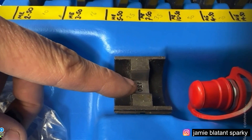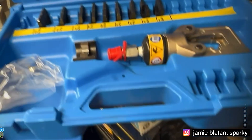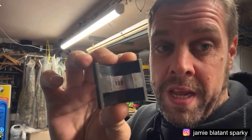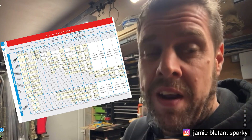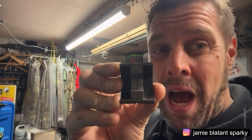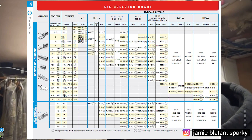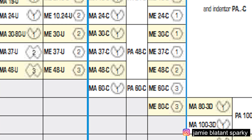What'll happen is - I think with a 120 - if you look in the back of the Cembre book there's a guide. I'd buy my lugs off Cembre, my dies off Cembre, my crimps off Cembre, because it's a package system. For the G head, I think a 120 you crimp it once. You don't crimp a lug down with as many crimps as you can get on - you crimp it according to the crimping chart. With the thin head, I think you do two or three crimps, but it'll tell you in the catalogue. Don't just crimp the thing to oblivion. You crimp it as many times as it tells you in the catalogue, related to the lug you're using, the die you're using, the head you're using, and the press you're using. Crimping is a science, not just something you do.